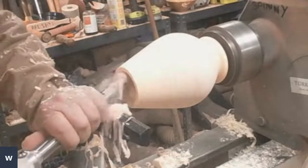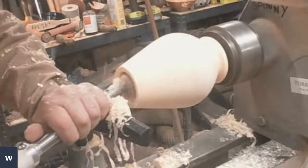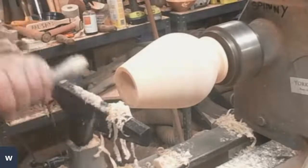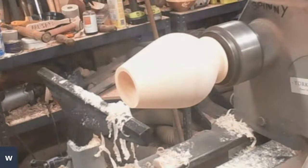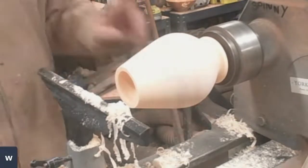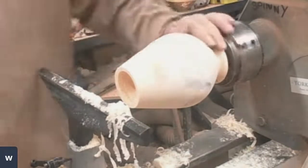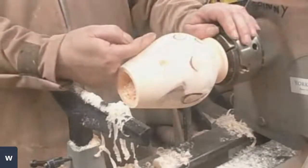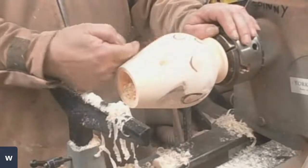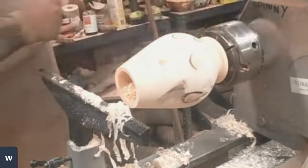Daniel DeBar says, how does the termite tip tool and the hook tools compare with the other hollowers? Right. Termite tip, I don't have one. The hook tool on this probably wouldn't work. Well, it would work, but as you can see, with all these branch inclusions here, they obviously go all the way through. So the hook tool would be hitting onto side grain. It's not really meant for side grain, it's meant for end grain.